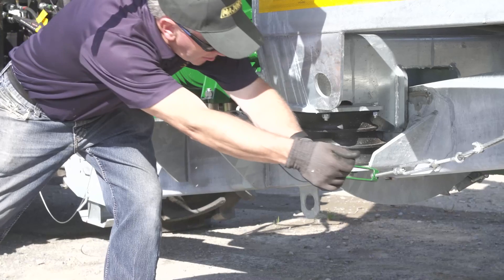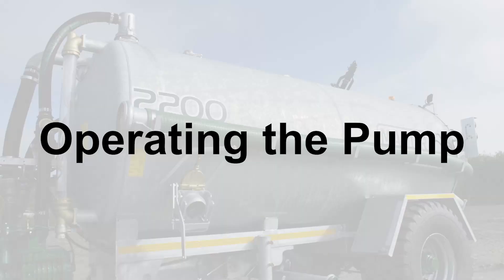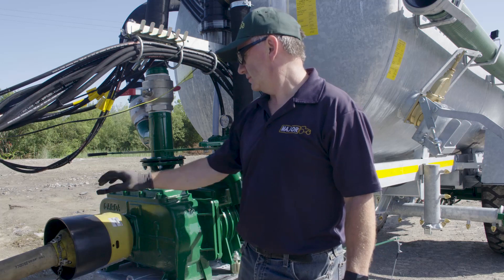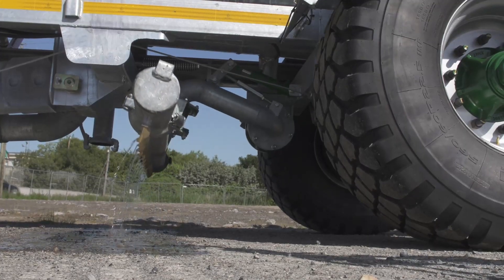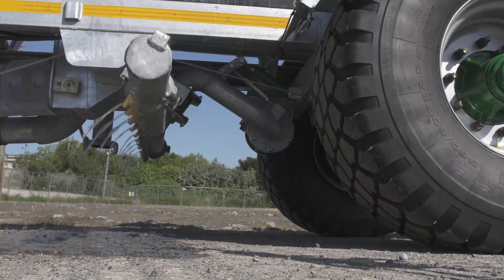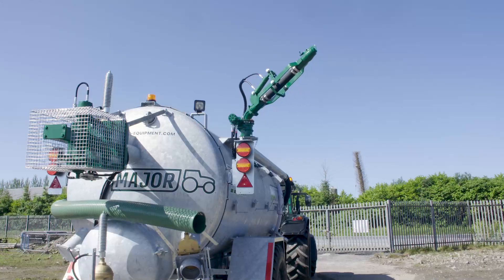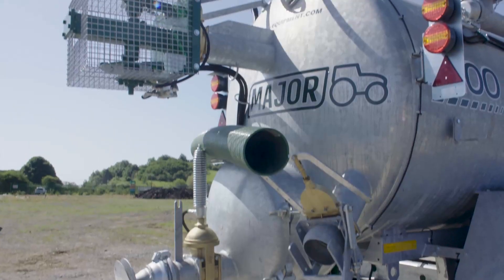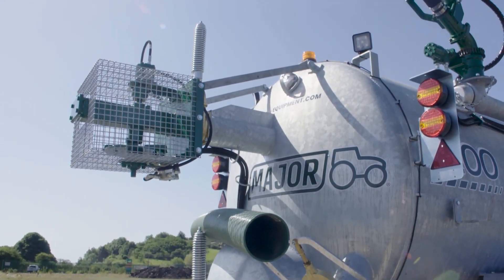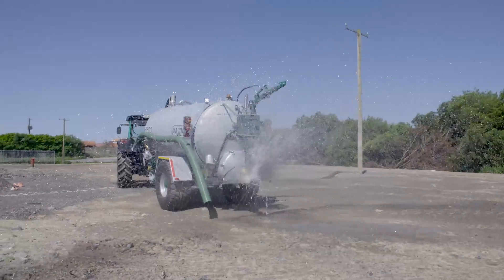Release the parking brake if applicable. There are two pumps on this tanker. Move the lever to the right to control the centrifugal pump — this feeds water to the road blaster bar and the rain gun. Move the lever to the left to control the vacuum pump, which feeds water to the splash plate and water dust suppressor.